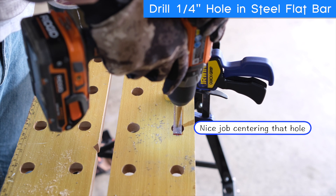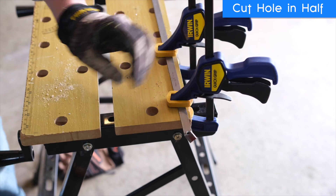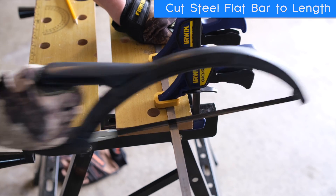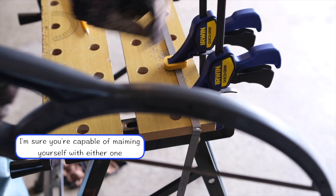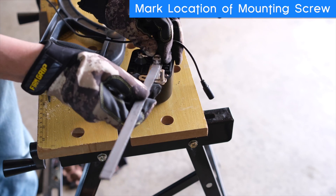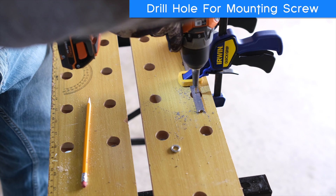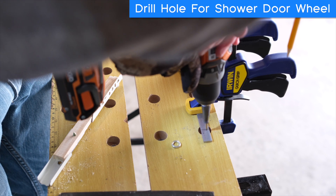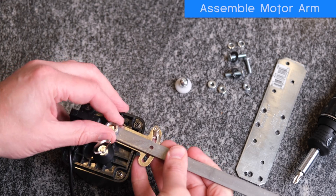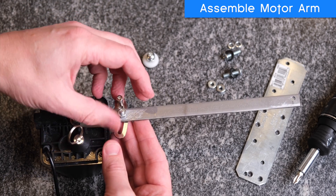Now take the motor back off. Drill a quarter-inch hole into a half-inch by one-eighth-inch thick plain steel flat bar. Cut the bar in half at the middle of that hole — this will create a notch that will hold the bar tight to the motor. Then use the measurement you took from inside the closet and cut the bar to length; for my door with 11.5-inch wide panels, I wound up with a nine-inch bar. You can use an angle grinder for a fun spark show, but a hacksaw works just fine. Be sure to file out any cuts and holes to avoid any boo-boos. Next, on the motor, loosen the nut holding the little valve arm enough so you can slide the new flat bar arm underneath. Mark where the groove on the short arm meets the flat bar, then drill a hole in the middle of the flat bar at your mark to fit a small bolt that will hold it in place. Finally, drill a hole at the end of the bar to hold the little wheel. I'm using a shower door wheel from Home Depot that fits perfectly in the drawer slide track we'll be mounting on the inside of the door. Now we can assemble the arm and motor and mount it back up on the wall inside the closet. This nut and bolt will allow you to make adjustments after the motor's already mounted, but make sure you use a lock washer to hold it tight after you make your adjustments.